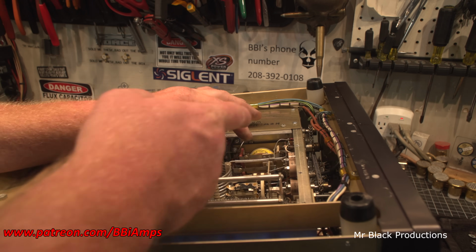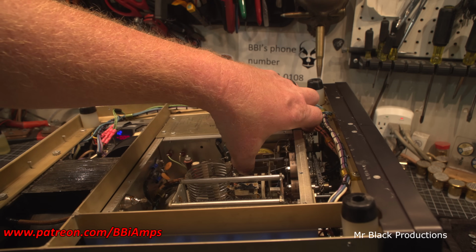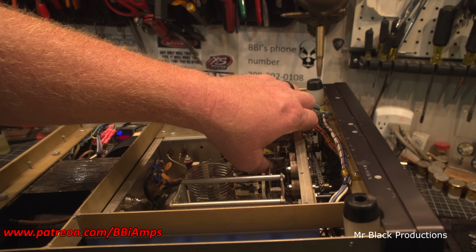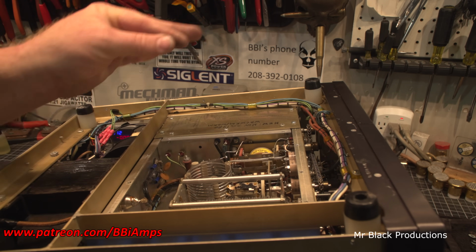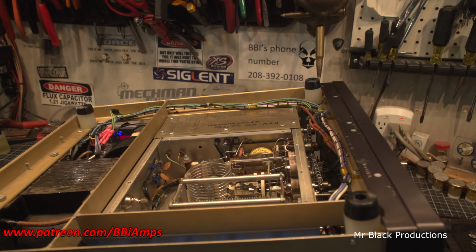And then we take our finger, and with the lightest amount of pressure all the way back here at the paddle, not out here at the contacts, but back here at the paddle, we close the relay by pushing in on the paddle very lightly. And how we use an up and down swirly motion. Getting very dramatic now, but it's okay. To clean the contacts, we're not looking for, oh, we're physically moving off powdered metal. We're cleaning contacts. We're just going to polish up the contact points.